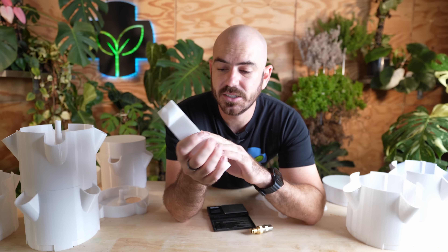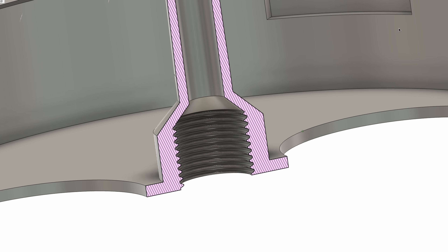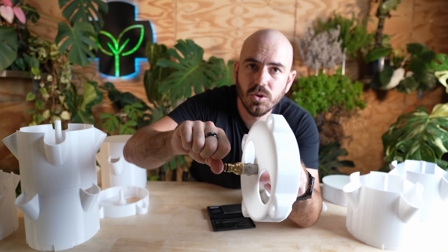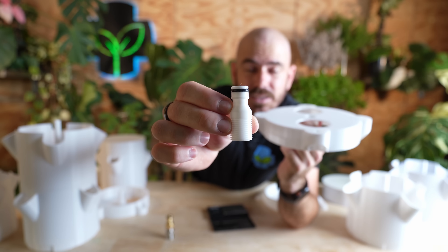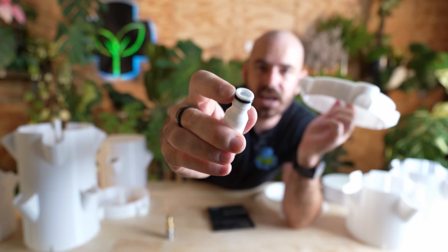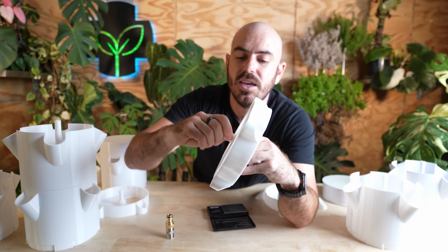When I designed this base, I designed it with a half-inch BSP screw at the base because I want it to be adaptable to the most things by the most people. That means you can adapt a hose nipple and BSP screw into the base and quick-connect directly to a hose which then connects up to a pump. For those asking why I didn't just 3D print that part — I have. This BSP-to-quick-connect adapter will also be available on my Patreon. You just add in a quick-connect O-ring — available on the Hydroland website, or you can pull them off other fittings — and it just screws into the base.